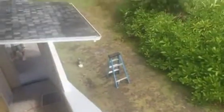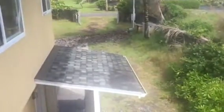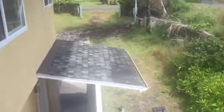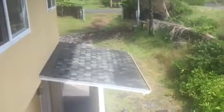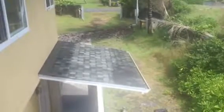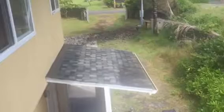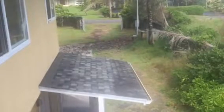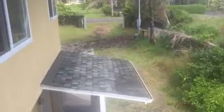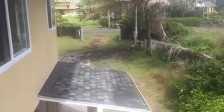We need to finish that trench so Don can drop his electrical. We've got 30 inches right there at the driveway, and they say you need 30 inches down to run the electrical line. This trench really threw me for a loop — all three of us were jumping in that hole and it's not a happy time digging it, but we almost got it done. I have to cut out cavities through the blue rock with my grinder. In Arizona they don't care, but in Hawaii they want you to have the same depth as the national building code.